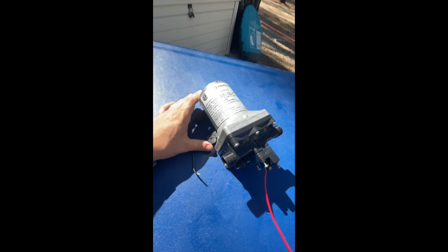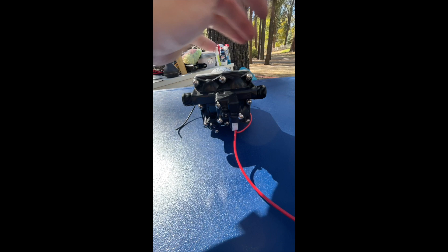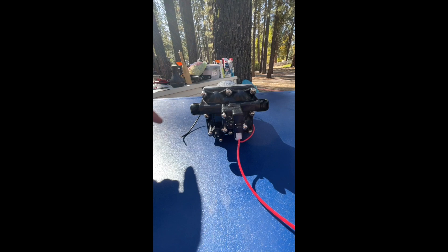This is one of the most common water pumps. What is a check valve? A check valve basically means we have a little arrow on each pump, so water is coming in from here and going out from here. If that little check valve doesn't close, then water will keep on going back.